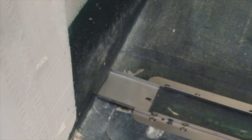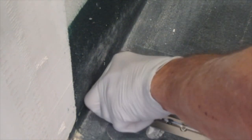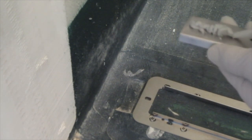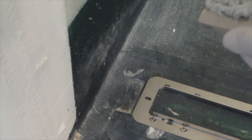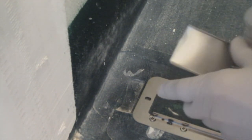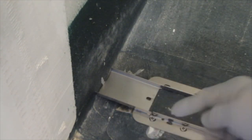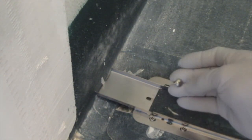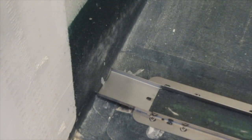I think the sealant used on the Go Board is the same type of stuff. I'm going to put a generous amount underneath to keep water from going underneath it, and I'm going to put some on both sides as well — that will keep my water integrity. Then it goes in with the screws that came with the clamping collar. The big round-headed ones go in there, and the small ones go into the clamping collar.